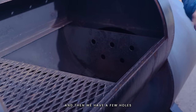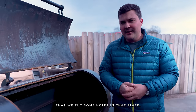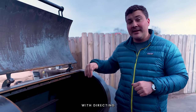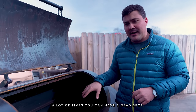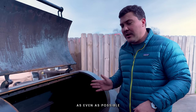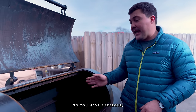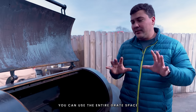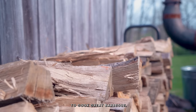There are a few holes in that plate, and it might seem strange. You might think — wait, I thought you were trying to direct the air up. One of the issues with directing the air up is right next to the firebox you can have a dead spot. In order to mitigate that and make temperatures as even as possible along the entire length of the grate, we put a few holes to let some of those hot gases in. So you have barbecue-worthy heat from one end of the grate all the way to the other — you can use the entire grate space minus maybe about an inch and a half on this end.